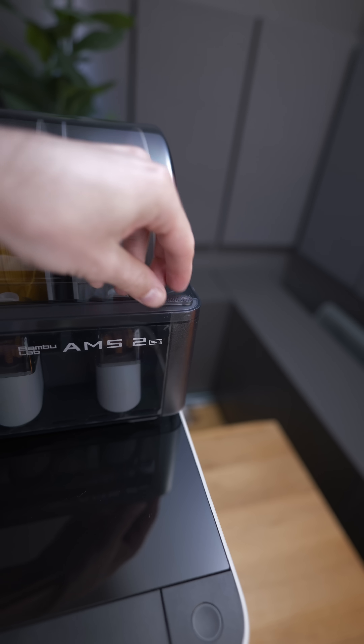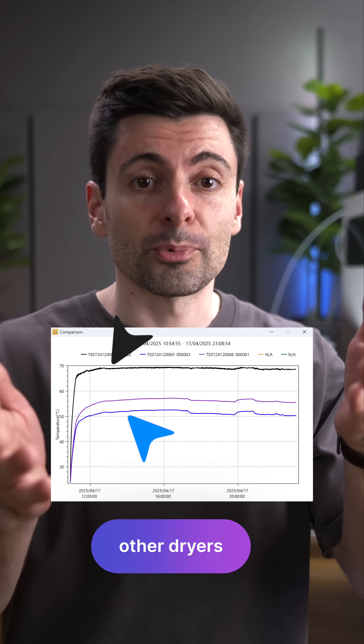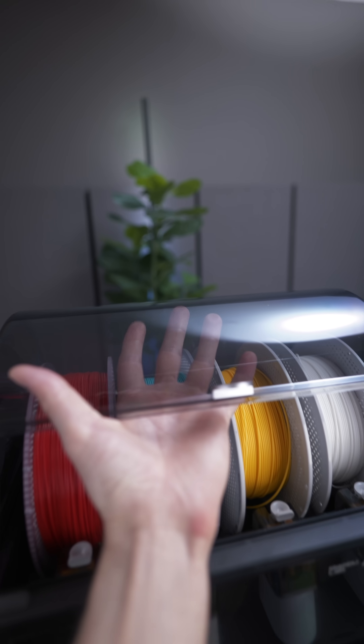Because the AMS is airtight sealed, it keeps your filaments dry inside. From my experience, many dryers on the market just heat filaments up on one side, while having a difference of almost 20 degrees less on the other side, which is not enough to properly dry filaments. This problem is not easy to fix because we like transparent enclosures which are thin, and because of this you get low temperatures on that side.